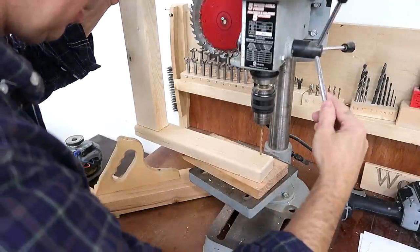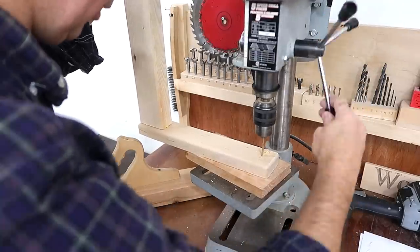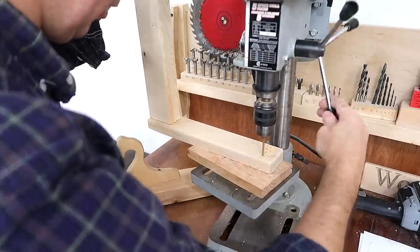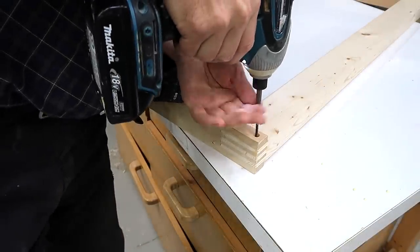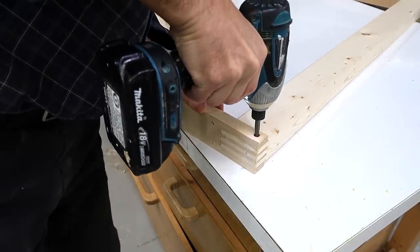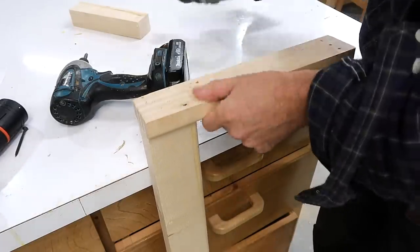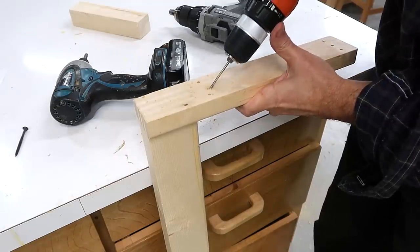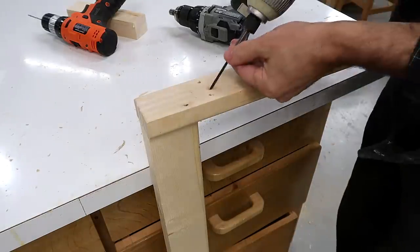This bracket is just going to screw onto the leg assembly to hold those vertical. I thought about trying to use some knockdown fasteners, but realistically I've never had the screw holes wear out from wood screws. I wasn't entirely sure about the strength of this joint so I added a reinforcing screw across it, plus one at a diagonal that kind of screws to brace the corner — kind of difficult to put in but it gives me a bit of extra confidence.